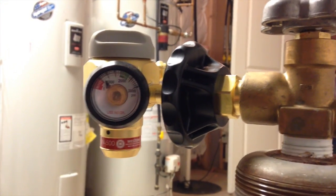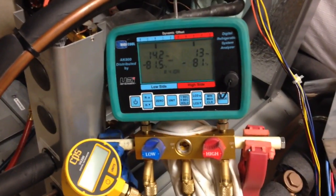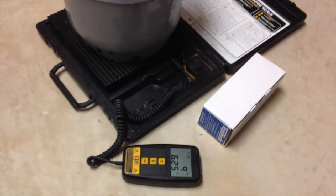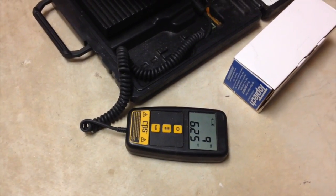700. All right, done reclaiming. Almost down to 15 inches of mercury. Have purged out our machine here and emptied out. Out of that geothermal — what was the rating plate? 56 ounces, which is 3 pounds 8 ounces. We've pulled 9 pounds 6 ounces out of that unit so far.